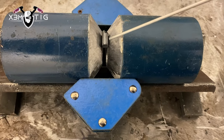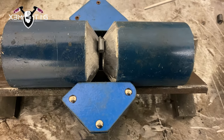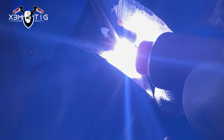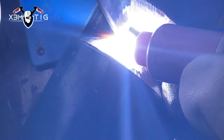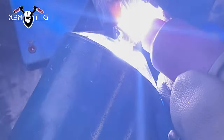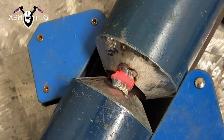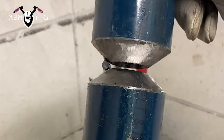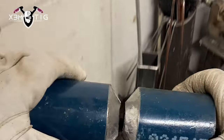For the gap at 1.8 I'm gonna use the bridge rod for tack. You can't do any root tack or bridge tack with wire itself, you gotta use rod. I'm just gonna put one tack on the 12 o'clock, flip it around, check for the gap. If it's even then we're gonna put another tack at 6 o'clock. Gap looks good, putting one on 6 o'clock.